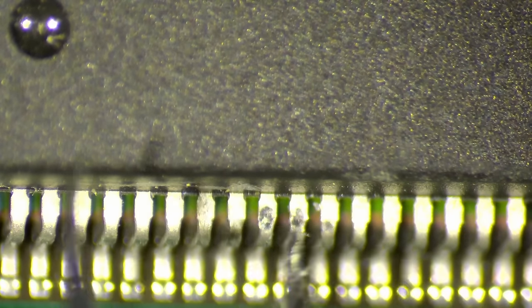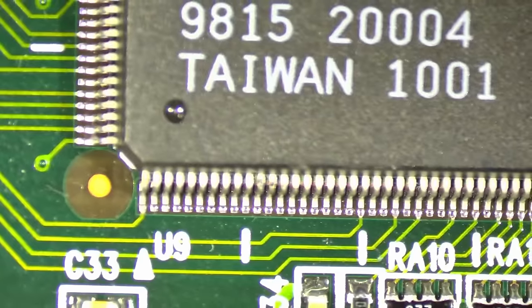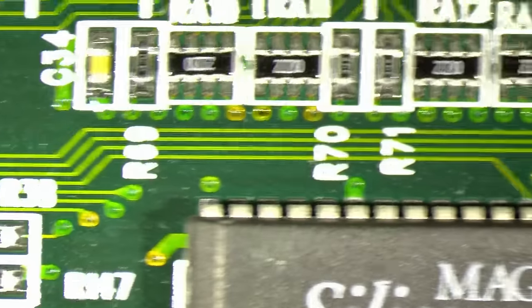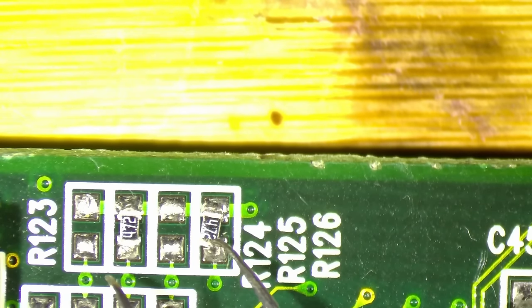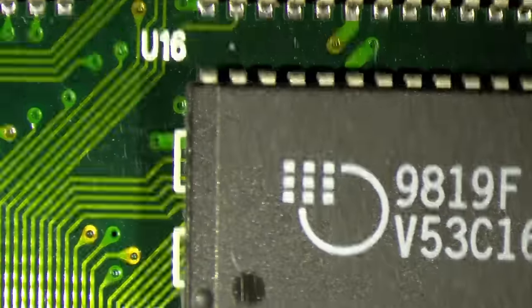This card probably was hit by other PCBs when it was in that big pile at the scrapyard. I'm actually surprised that none of the pins are bent. They all look quite good. Okay, and now I'm looking at the SMD components. I think memory chips should be okay. Okay, here is one that we probably just have to resolder. Okay, this side looks good. Only this one missing capacitor, this resistor, and well, the legs, this is a larger task, but still okay.